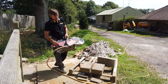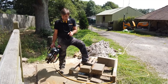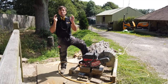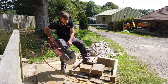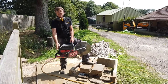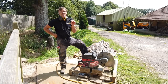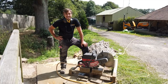To keep the cut straight — imagine holding a bicycle wheel by its axle and spinning it, then trying to turn it: the gyroscopic effect wants to make it go straight up, just like riding a bike. It's so well weighted down the centre, everything balanced, that once you're running at full speed you just relax and like a pendulum it swings dead straight and cuts everything nice and square. It takes a little practice and confidence, but the benefit of no fumes and no exhaust heat from petrol is a winner. On with the lintels, Chris!